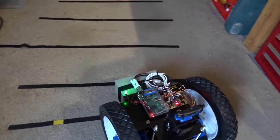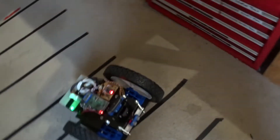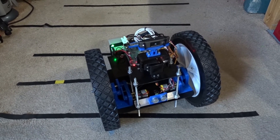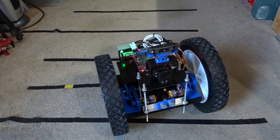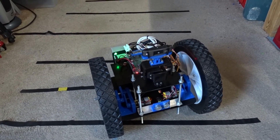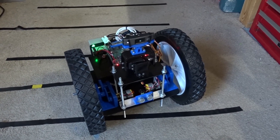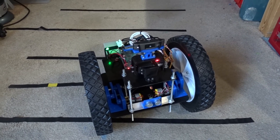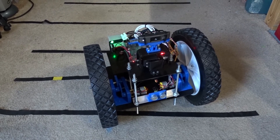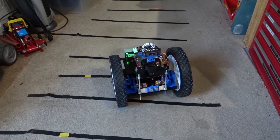So there we go — it's not too bad, but there's quite a bit of work to do. You can see some of the turns were off a little bit. The Raspberry Pi is just checking to see when an angle has been reached, and I think it's stepping the program on a bit too quickly before it's actually settled into the right orientation. I also think I need to do a bit more work on the calibration of the camera encoder, including error handling if it misses some key points or matches. But as a first go on a proof of concept, not too bad.